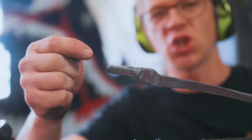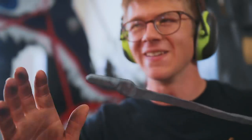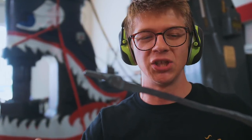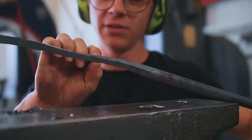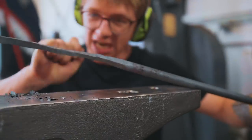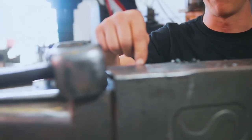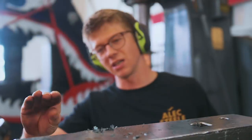As you can see, I haven't finished our tong bit — the drawer of the tong. I want it to be stout because it's going to be in and out of the forge oxidizing; there's no point bringing it to final dimension. We use the far edge of the anvil for our most aggressive tapering and reducing stock size. But the far edge creates a forwards taper, and we need a reverse taper, so we're now going to go to the nearer edge of the anvil, which is how we make tapers that come towards us.